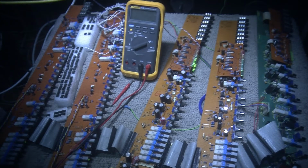So it's really nice because you can isolate things, and you can really crank up the volume and see if you've got any kind of interference or any kind of noise on the board. So it's nice to have this set up. What I do is I install the group channel and then I crank the volume on the headphones all the way up to full, and then I take out the signal, and then you can hear if there's any noise anywhere.